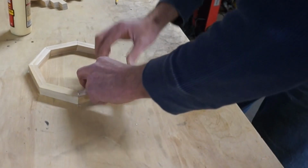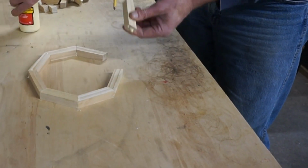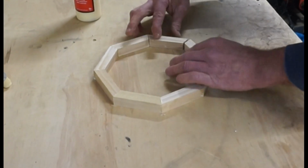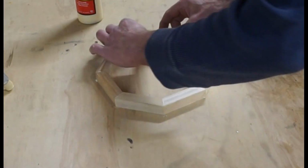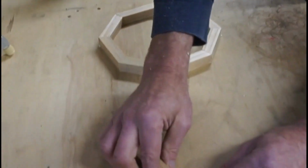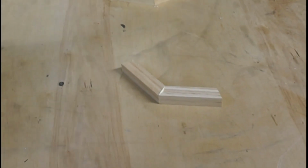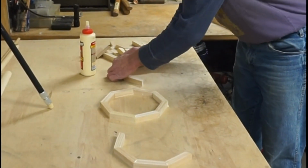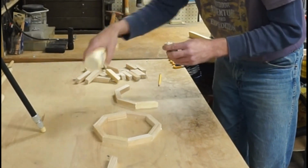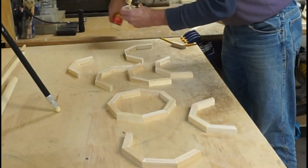Remember to put enough glue on, and always press and hold your glue joints tight. Smearing them in. And remember, the glue takes 24 hours for a good cure. And for one of my favorite quotes, it's called woodworking, not wood perfection. So there's always the ability to sand and shape and modify if it doesn't turn out to be exactly perfect.